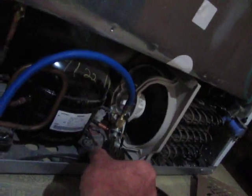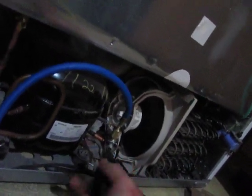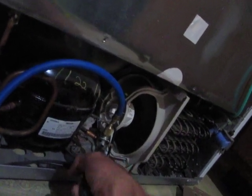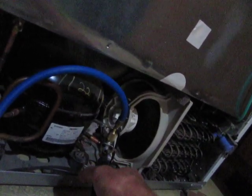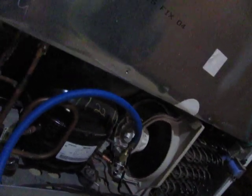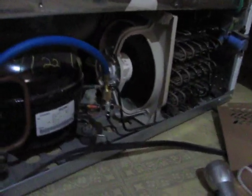You need some kind of hex tool to close the little thing inside the bullet piercing valve. There's a little center screw there. Once it's tight — don't want to get it real tight — it's on a copper tube. Pressure is good.